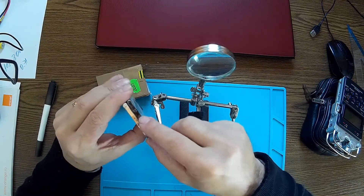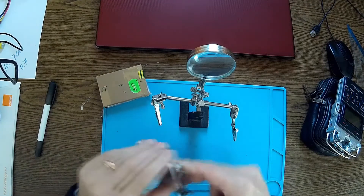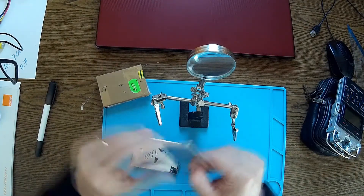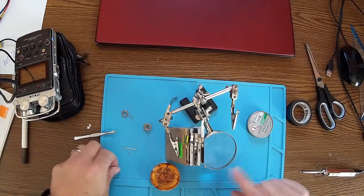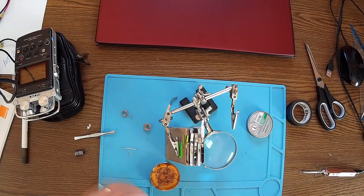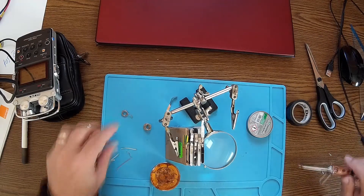You can see all of these elements already have a thermal fuse, so if something wrong happens the fuse will blow in a split of a second. You might ask why I'm not isolating these with tape or something — not yet, because I have to put the balancing cables in first since we're going to have a balancing port too.